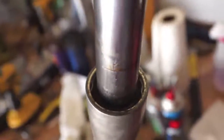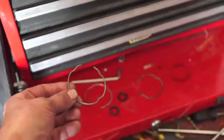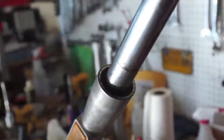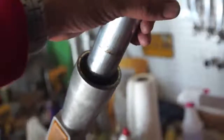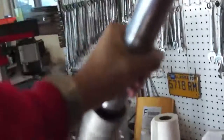And then you can see down in there there's a clip, and that clip looks just like this. That's what holds your fork together, so you pop that out just with a screwdriver. Now the fun part — you get the oil seal out, and you do that just by using this like a slide hammer. You just pound it like this — there she comes. Out comes the oil seal.